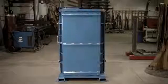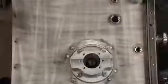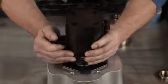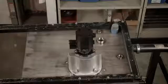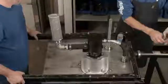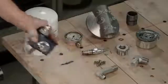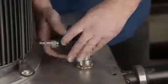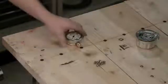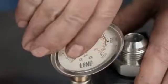A powder coat paint job completes the housing. Workers now assemble the crusher's hydraulic power unit. After bolting a pump motor to the lid, the team flips it over and inserts a hydraulic pump into its housing on the lid's underside. They plumb the pump and attach a suction strainer to filter contaminants from the hydraulic oil, then flip the lid back to the top side. One of the workers screws a pressure relief valve to a fitting that connects to the pump on the other side of the lid. This valve will regulate the flow of hydraulic oil to ensure there's adequate pressure for the crusher's operation. If there's too much pressure, the valve will shut the crusher down.